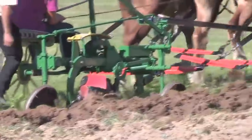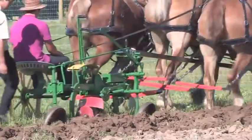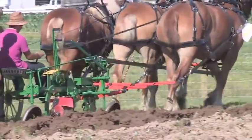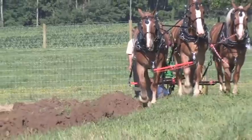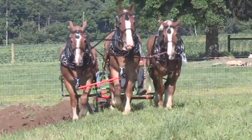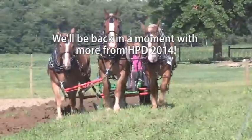Draft hitch can be adjusted horizontally with a hand lever without stopping the plow. Optional weights can be added for hard, rocky conditions, allowing the plow to remain stable while the leaf spring is fully activated. The skimmer is designed to assure that all surface residue is completely turned over — very important. This tool is essential for weed control and unwanted regrowth when plowing sod. Some of the old worn-out plows are going to leave a strip — just a small, narrow strip of sod still growing between every furrow. They've got this bottom on there that's going to completely bury all the trash.